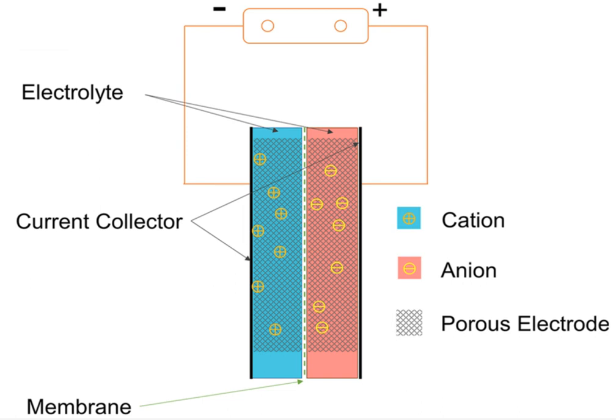Although the specific energy of supercapacitors is insufficient compared with batteries, capacitors have the important advantage of specific power. Specific power describes the speed at which energy can be delivered to, or absorbed from, the load. The maximum power is given by the formula P_max = 1/4 · V²/R_i, with V equal to the voltage applied and R_i the internal DC resistance of the capacitor.